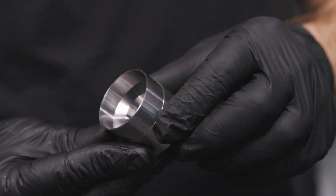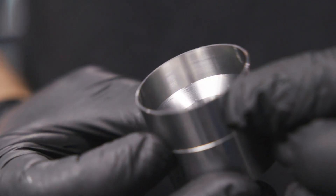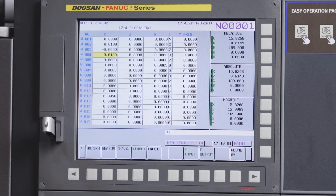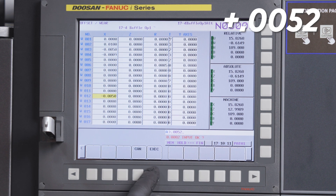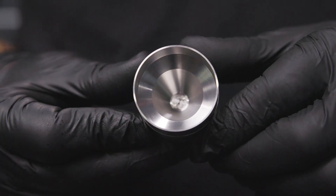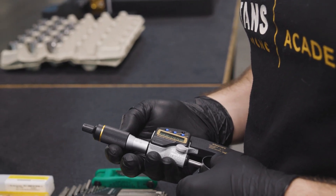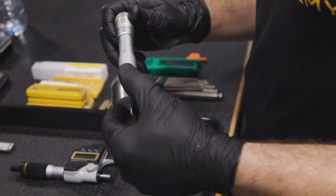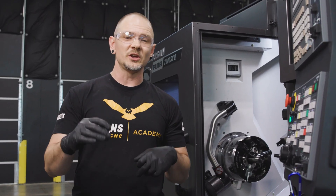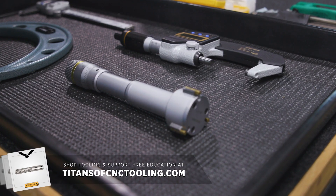If you only have a few parts to cut, or maybe you're worried about your machine not hitting that same size, you can go ahead and go through these steps again to repeat the process. If you're setting up for a production run and you do trust your machine, go ahead and take those offsets off your roughers and hit size the first time. One other caveat: depending on your part features and how they're related, sometimes when you part a feature off it can cause ODs or IDs to change a little bit, so it may be a good idea to check them one more time before you consider the process dialed in. That covers the basics of dialing in an OD or ID feature. If you're interested in purchasing any of the tools you've seen today, please visit us at our store. Thanks for joining us — we'll see you next time.